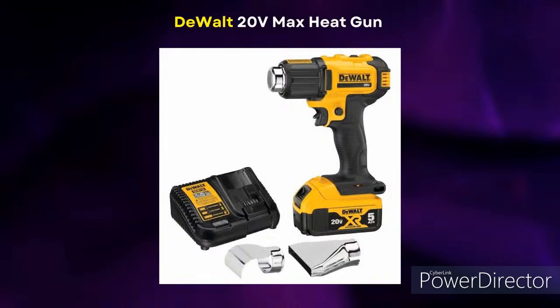A lot of it comes down to training too. We had one time where one of the apprentices heat shrank a whole bunch of stuff but didn't put it over the energized parts. If you're doing heat shrink out in gas and oil, you want to make sure the heat shrink is covering the parts that are becoming energized — we don't care if it's covering nine-tenths of the conductor down below.